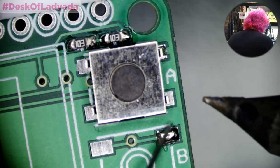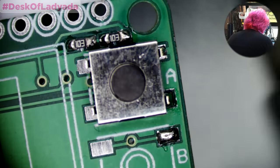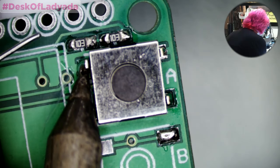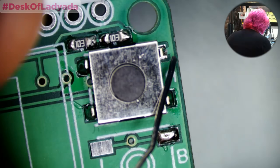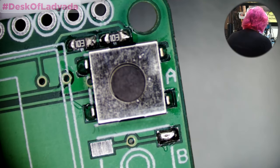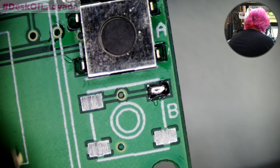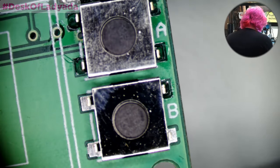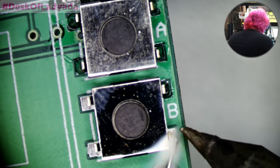Is there a way to check the connection after you solder? I just do it visually — Lady Ada is the optical inspector. You can kind of see the fillet. What's neat is I don't need pull-ups or pull-downs for these buttons because it's built into the IO expander — that's what I like about it. Built-in pull-ups.